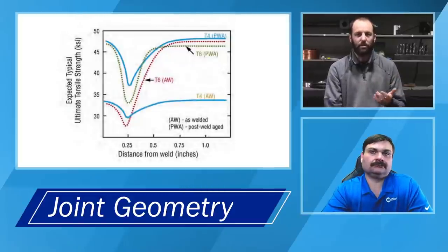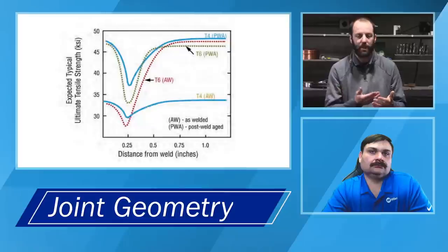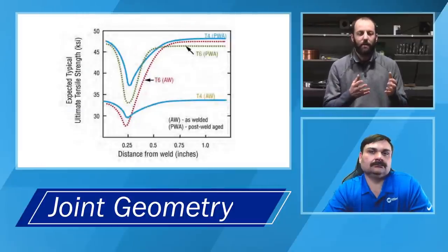So again, going back to the concerns about depositing hydrocarbons on the surface of the material, great for post-weld cleanup. If you've got to grind your welds off flush because that's the appearance that you want, those are going to work better. But in terms of preparation, we want to use more of a non-bonded cutting material, like a wire brush, the carbide burr, a very coarse hand file, something like that, where we're actually cutting the material and we don't have that chance of some sort of a lubricant or bonding agent getting deposited onto the material.